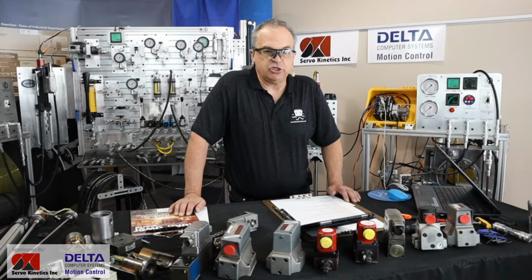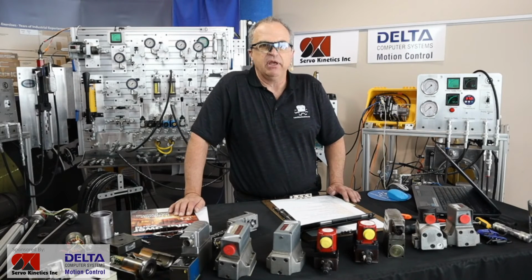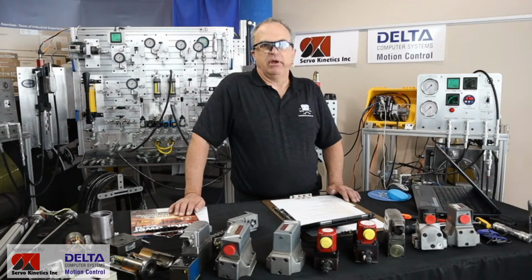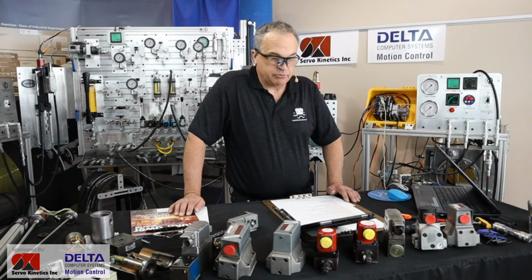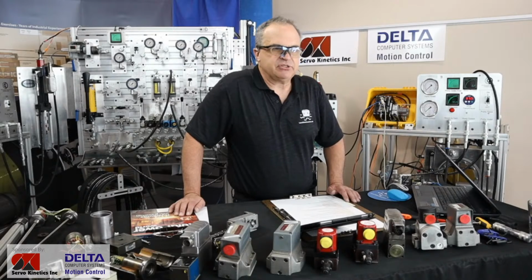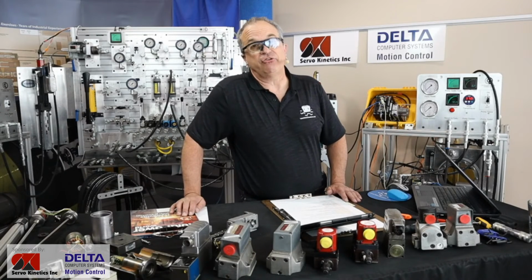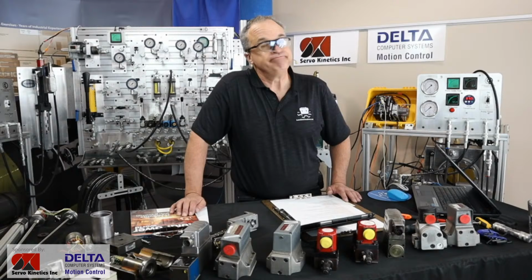I have seen some discussions from the experts and professors at Milwaukee School of Engineering that I think about 15 years ago were having, and basically settled on a definition for their purposes that a servo valve was any valve that had less than 3% of overlap, and I think that includes all the valves that then move into the zero lap and underlapped spools as well. I think the ISO standards have some slightly different designations where they speak about the testing pressure that servo valves are flow rated at, and that doesn't give you quite the same distinction that many are looking for. So again, it seems that the modern day discussions center around, is the valve responsive enough to deliver the necessary accurate servo action? Then it's a servo valve.